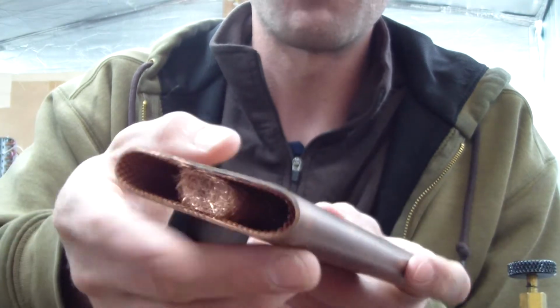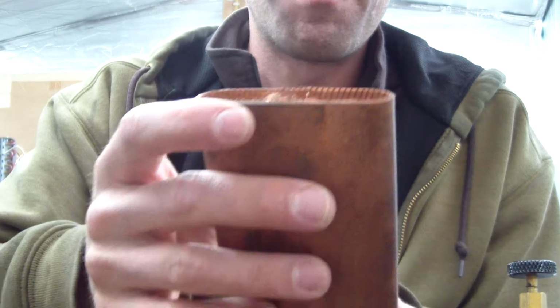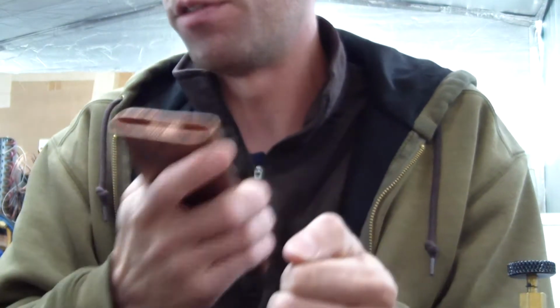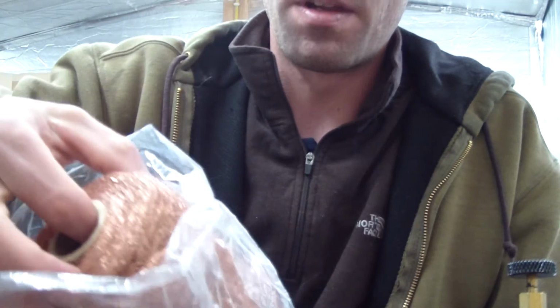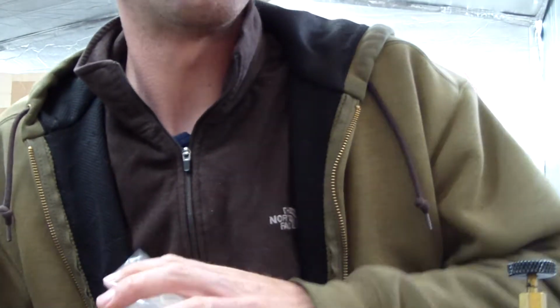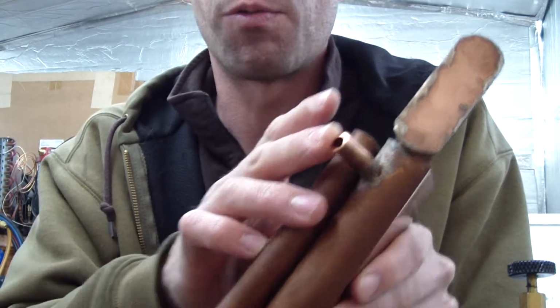So there's a lot of different interests that I had here on the way this worked, and part of me wishes I would have continued the project, because just the design of the evaporator itself was very fascinating. This is that copper wool material. It actually came from locally here in Oregon. I'm not sure where it's manufactured. So it's a little expensive, but what I needed to fool around with. Now, mostly I worked with about a 3/8 inch riser to the condenser.